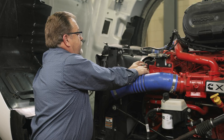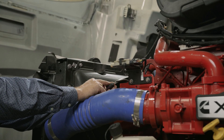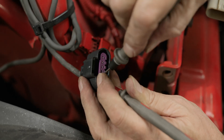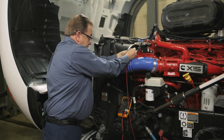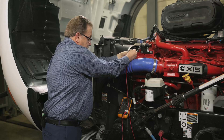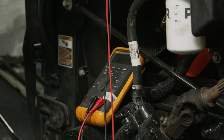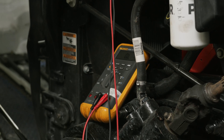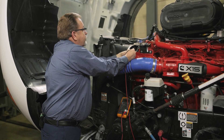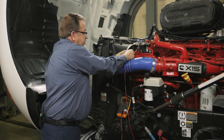We want to check the resistance between the red wire and the blue wire, which are your power and ground for the fan drive. We'll get a couple of probes here and get our ohmmeter set up. Right here we got a resistance of 11.1 ohms, so we have a good resistance. If there isn't contact, or we have a bad coil or a damaged wire, you'll have zero resistance or an out-of-limits reading. If the coil was bad, you'd have an out-of-limits reading on the resistance.